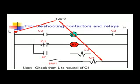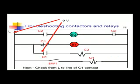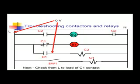We check from L to line side of C1. And again, 0 volts. We're fine. We check from L to the neutral side of C1. We have 120 volts. Now, that load might either be good or bad. Let's check a little further. Remember, voltage across a working load is 120, or source. Voltage across a bad load could also be source. We go to L to neutral side of C1, so we know that branch is good.